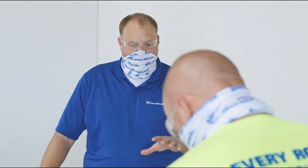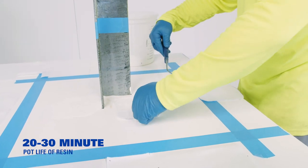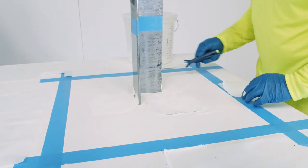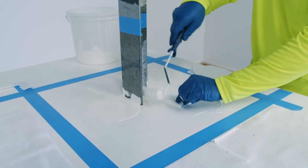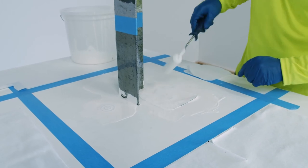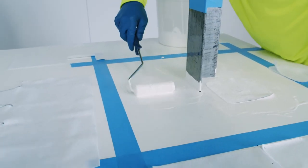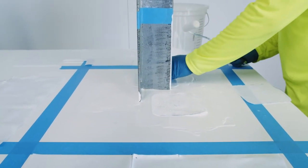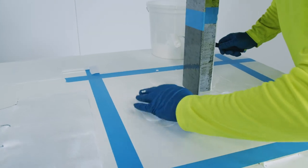This really leads to why it was so important to do the dry fit of the fleece earlier — with a 20 to 30 minute pot life, you don't want to be out there trying to cut extra pieces. For the vertical surfaces, it would never hurt to go ahead and get a kiss coat of resin to start building some of that thickness. You really just want to make sure it's a nice consistent coat that saturates all the way through, and that anywhere you've got reinforcement, there's resin underneath.